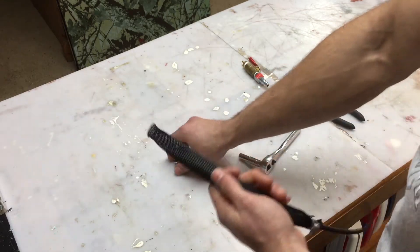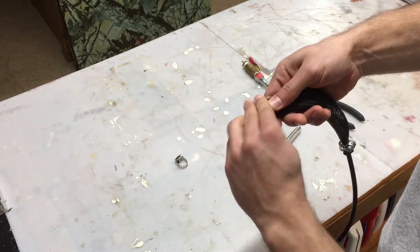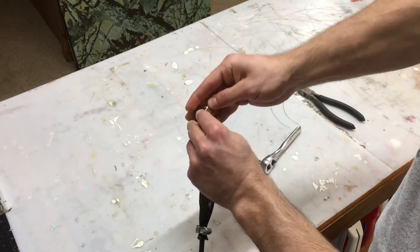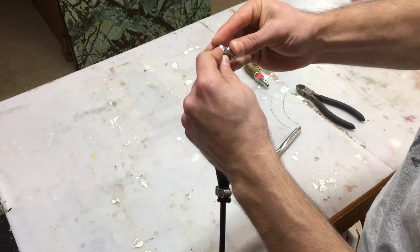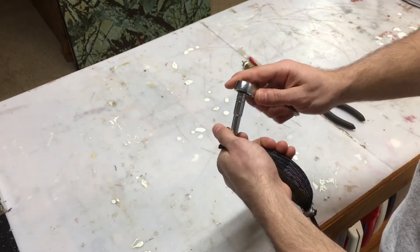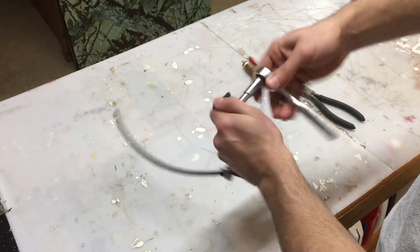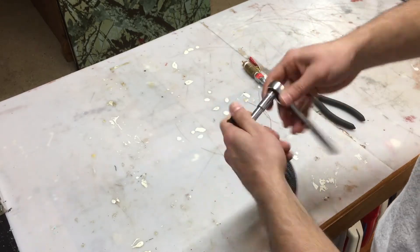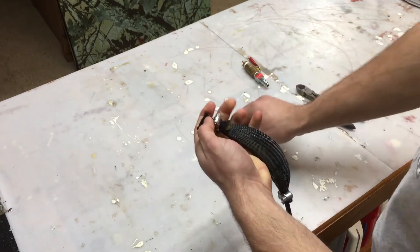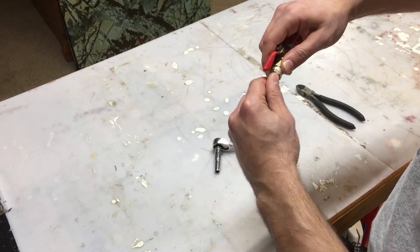Then I like to fold over the hose clamp. From here you're going to squeeze and pinch the latex tubing to the end of the sheathing, fold it over in half, and then add our hose clamp. What this will do is restrict the air flow on both ends so that the air muscle can contract by being filled with air. Once again, tighten this down — make sure not to over-tighten, as you can cut them. Tighten everything down, and once you have it tightened, we're going to move on to adding the valves.